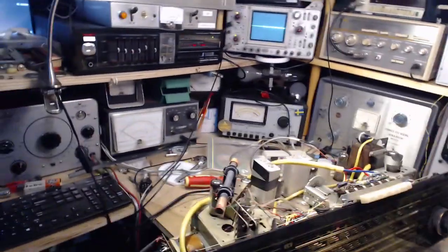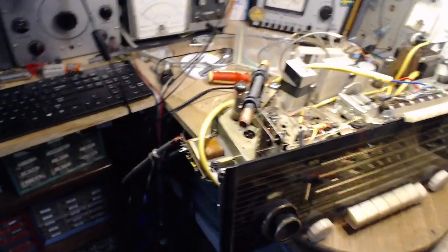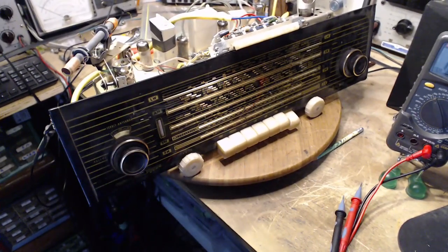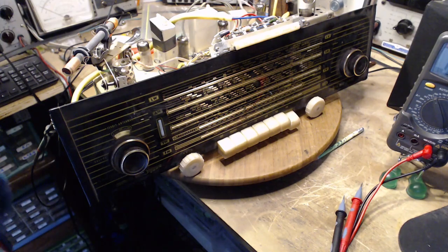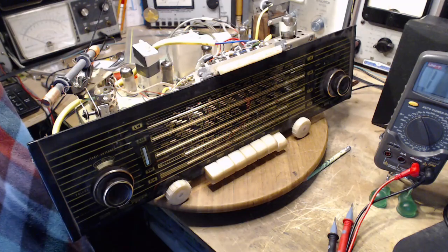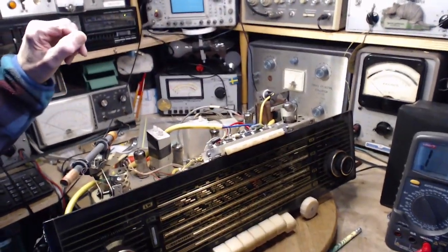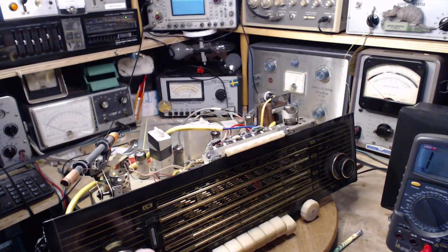A little issue hooking up the oscilloscope here to the output of the speaker. I was concerned that maybe there's a ground on one side, which is quite common. So I poked with my ohmmeter for a little while and decided, okay, maybe it's this one. So I've hooked it up. Nothing bad has happened. We've survived that. Okay, so up here we're on AC on the scope. Nothing there. We still have the speaker hooked up. Okay, what do we get?